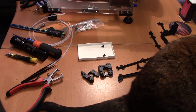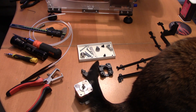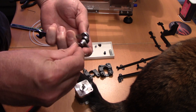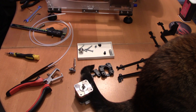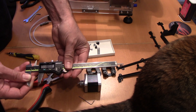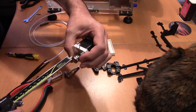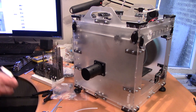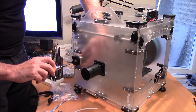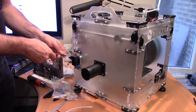Once the hotend's in, we put the extruder pieces into place — and my cat is absolutely determined not to move off this desk no matter what. She's very much my witch's familiar. The extruder goes together fairly straightforwardly with five screws and a spring-loaded mechanism. They're quite fiddly — getting the exact placement of the drive wheel 19.5 millimetres off the body means that when you install the plastic outer parts the filament lines up properly. The extruder goes on with one screw at the bottom to align things, two screws at the top for structural support, and then the screw at the bottom holds the filament wheel, bearing and spring-loaded mechanism.